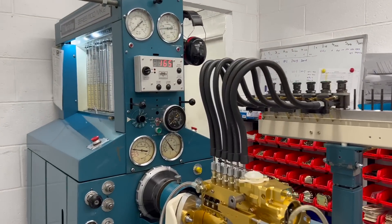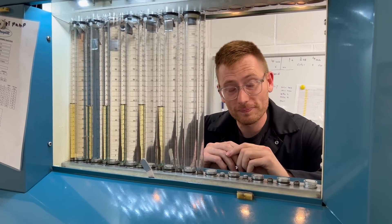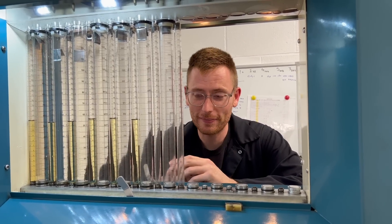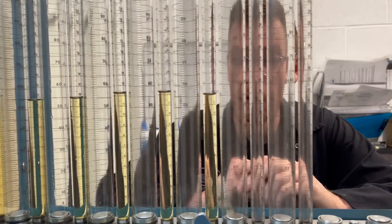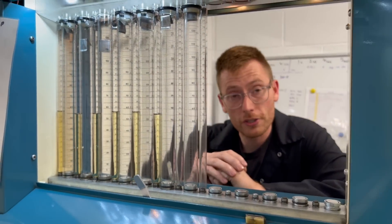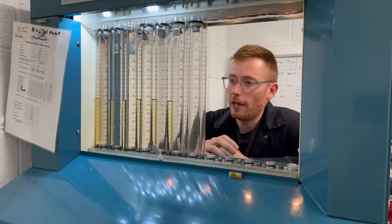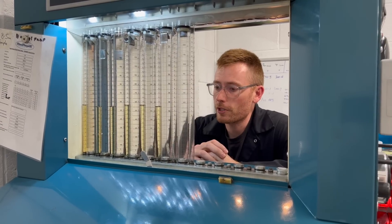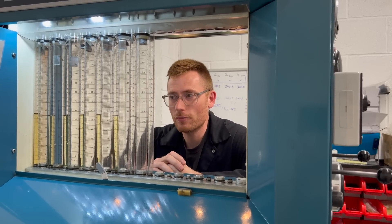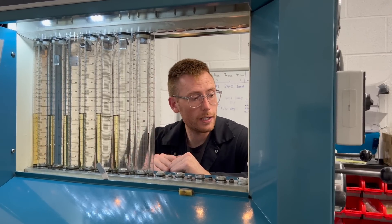That wasn't staged. That 2mm did just take the 20 CC off that I wanted, and now we have a 120 CC average. As you can see, we have to average it out amongst all the cylinders. Generally, the middle of the RPM range and middle of the throttle range, you are going to see this kind of difference regardless of whether it's a Mercedes-built pump or whoever built it. So there you have it — about a millimetre takes off about 10 CC with our Alda. Obviously it's not super accurate; the accurate way, if you wanted to know your CC, would be to put it on a test bench. But you've just seen how to reduce your Alda setting by 20 CC.